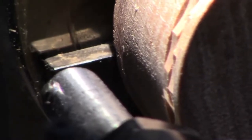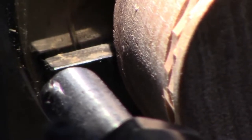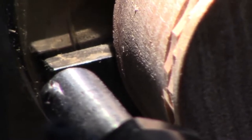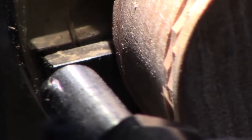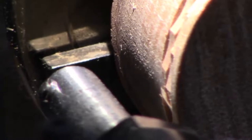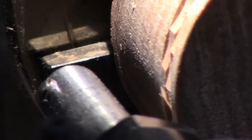But also, I would recommend that you don't take highly figured wood and try to ornament it, because your ornamentation is going to get lost in the grain. Where a lot of folks use blackwood is because it has no grain to speak of, and it holds great detail. Pass that around. And what about like Corian and things like that? Corian works great. Corian and most plastics do quite well. So the choice of wood is important also.